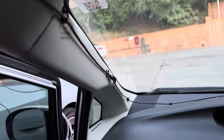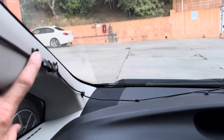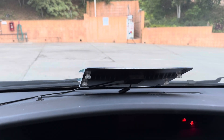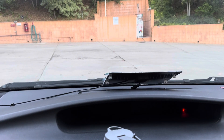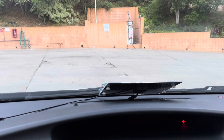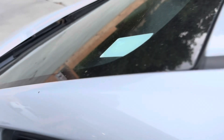The cable terminates here to a USB-A connector, and the solar panel — a 5-watt panel — connects to that. I suction-cupped it to the windshield, which allows me to put up my sunshade easily and it's not obstructive of my view when driving. This whole setup works pretty well, keeping the node between 70–90% charge. I try to park it in the sun as much as possible, which keeps it pretty low maintenance so I don't have to worry about plugging it in and charging it from a power source.